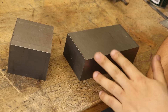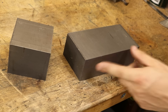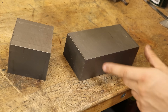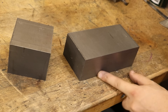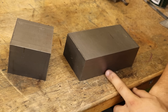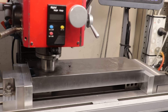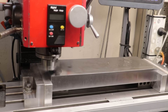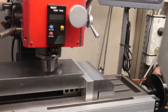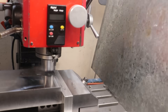The problem is that these pieces of steel have been squashed and like a spring there is a fair amount of tension built up in the internal microstructure. Once I start to machine it unevenly — say taking more off one side than the other — the stress that's built up is going to start to let go and the part is going to start to warp. We saw this a few weeks ago when I made the cross slide: I took a whole chunk off one side, flipped it, and the part had a huge dip in the center because the middle had sprung up — there was more stress on one side, and by machining away the other side I'd upset the equilibrium.